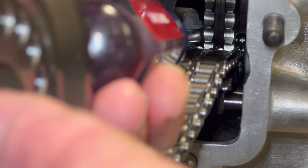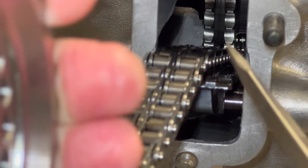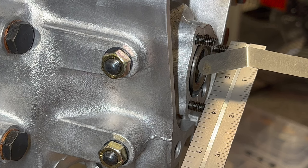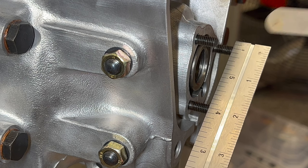It's a little bit difficult, but we'll try our best. So right now I've got the screwdriver placed behind the chain gear on the intermediate shaft and we can see that it's going to come forward - moving that forward a little bit - and then I can go the other direction. You can see it move back. That's why we need to do this with the chain blocks off first. Now we're all the way back, that's where we want to be to check our measurement.